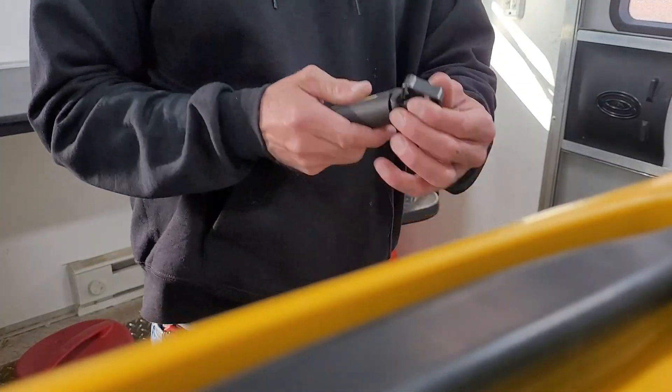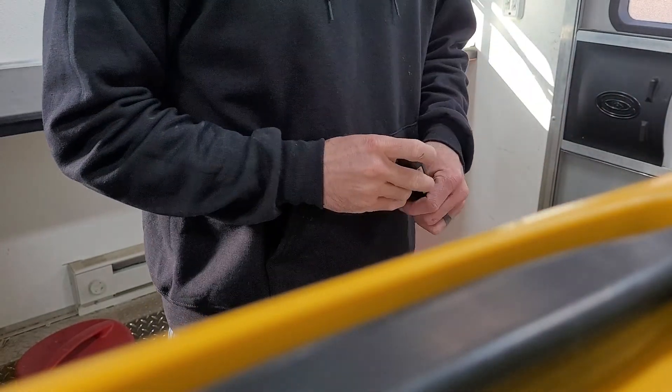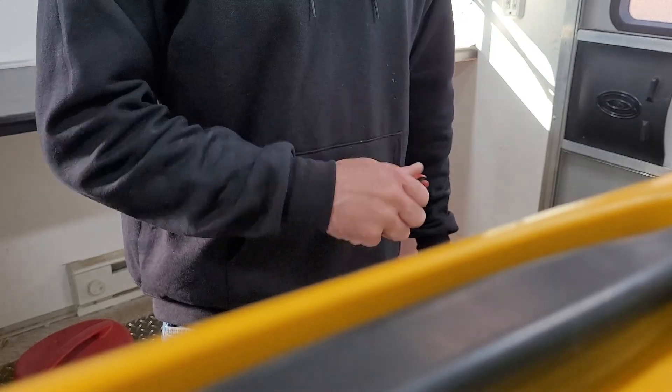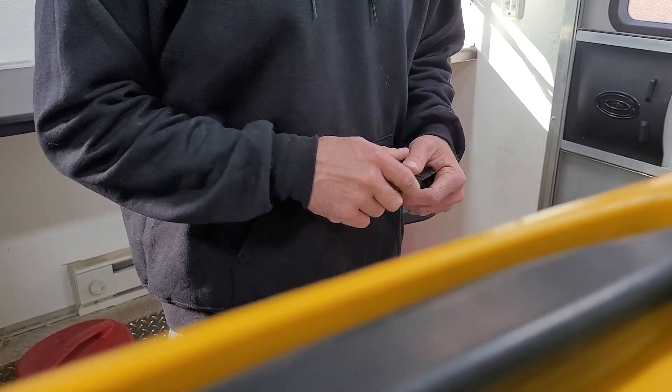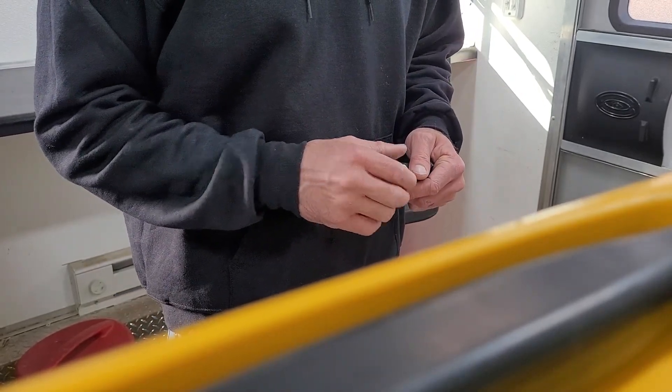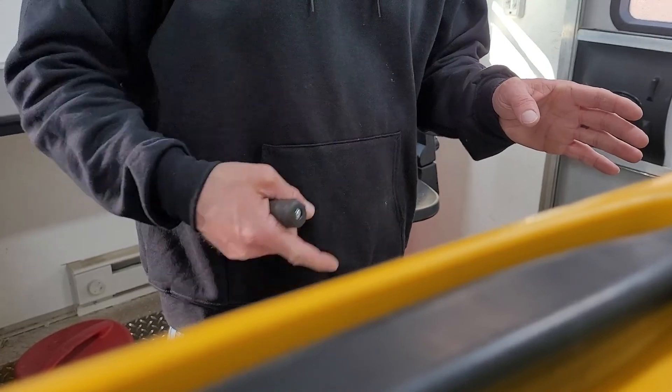At each end you're going to do a flat, perfectly straight ring cut. That's where the hard part comes in. You're going to take a knife with a tip on it, a razor blade, a pair of needle-nose pliers, maybe some really rigid tweezers, and you're going to try to peel up a little bit of that jacket where the straight ring meets the spiraling ring. And that allows you to pull that section.